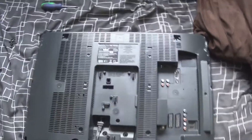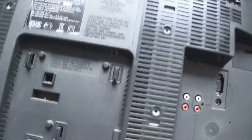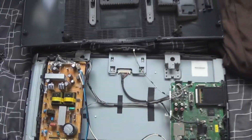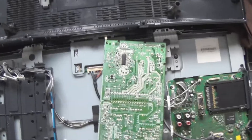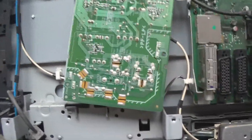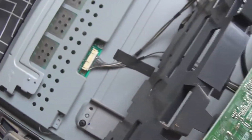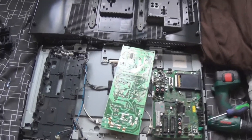Here's the last 26-inch TV I'm working on — the Sony KDL-26S3000. I think the screen's just glitching out or something. What I'll do is get it remounted on the stand, but this thing needs a hoover out before I do anything. So I'm going to get the hoover and just give it a quick clean. I've cleaned out the TV — there's nothing obviously wrong yet. What I like to do whenever I get a TV is always check out the solder joints on the power board and also clean it off with a vacuum, just to make sure there's nothing that could risk shorting things out. This TV's full of smokers dust as well but it's cleaning up nicely. I'm going to finish cleaning it and then put it on the stand and see what it's doing.